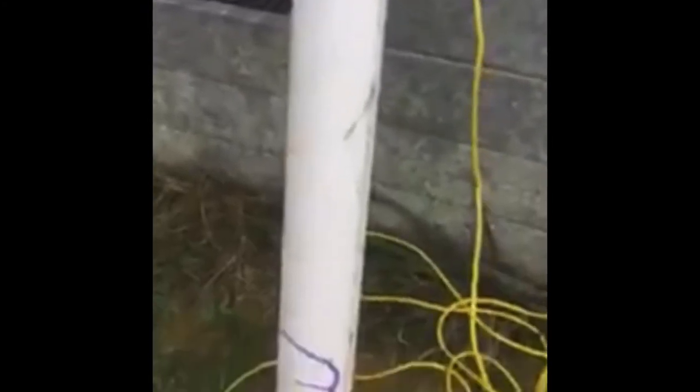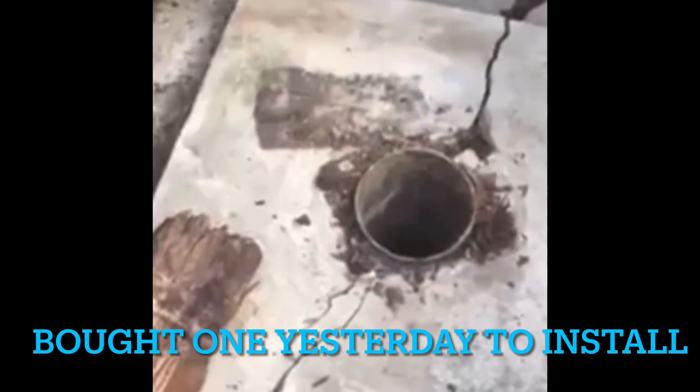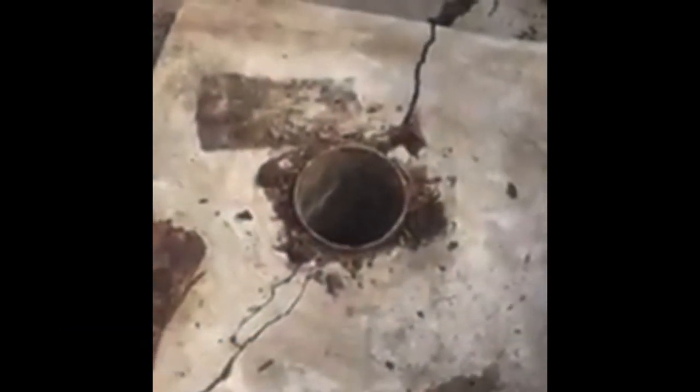So, if you find one of these on your property, you have a well. Get you some rope, check the depth and everything, and then make you a well bucket that'll fit down it, and you can use your water. Now, eventually I will put a pump in this, a deep well pump, and I will use it for things in the house. At that depth, at 25 foot, at 75 foot, the water's gonna be well filtered out and everything, so I will get the water tested.